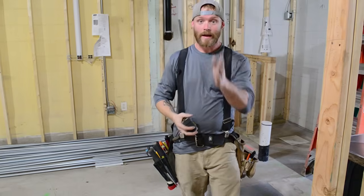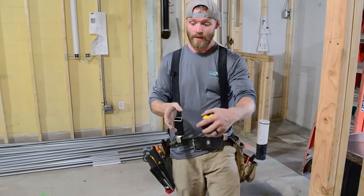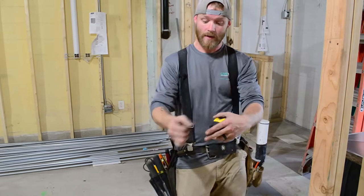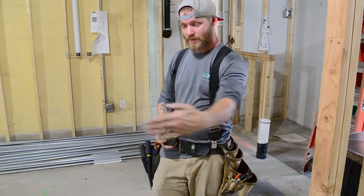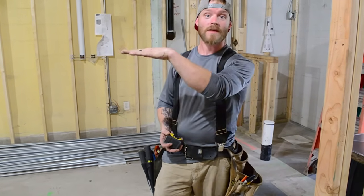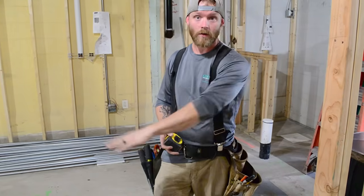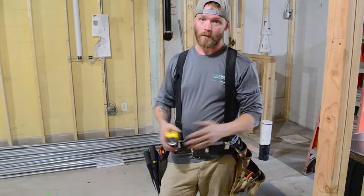Well, you would want to say, I need a forward 90, a 90 that's on the forward end of that piece of pipe, not a back 90 where you would mark it and turn your bender backwards, but a forward 90. And then when that turns, you need a high offset. So that tells the person, oh, you need an offset that goes up. Or if you say a low offset, oh, I need an offset that goes down. You can use the same thing for high kick and low kick.